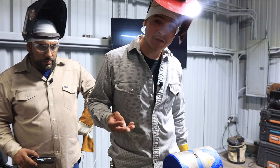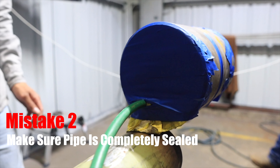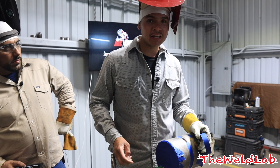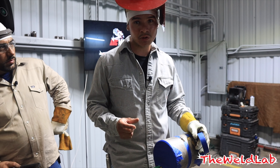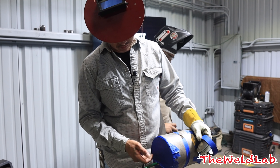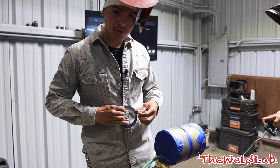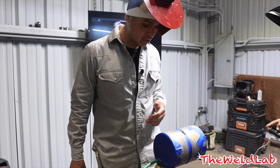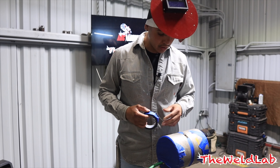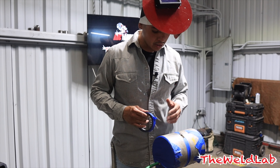We're about to weld and I noticed another mistake — whenever you do stainless you want to make sure everything is covered up, no holes. He forgot to close this up all the way. Make sure everything's taped up — all it takes is a little bit of oxygen to get in here and you get porosity, you'll fail your test. It might look good but when they shoot the X-rays they're gonna see those holes in there. Everything needs to be closed off front and back. Argon is heavier than oxygen so it fills everything out from the bottom. I'm gonna fix this for him and then we'll get started.